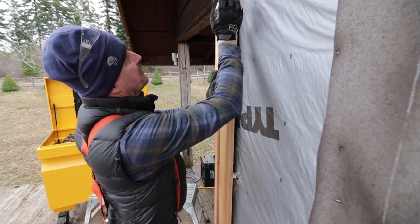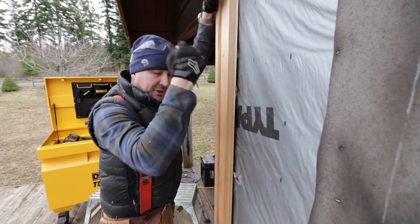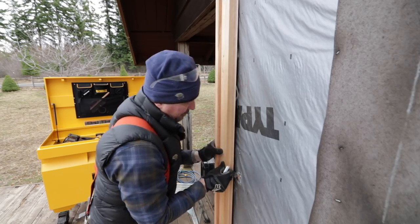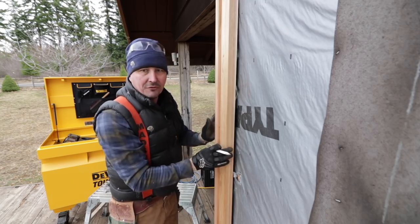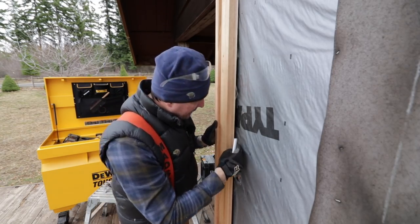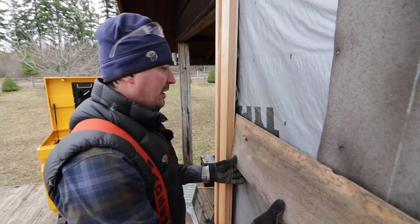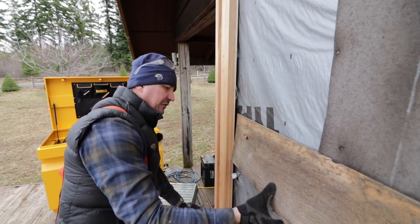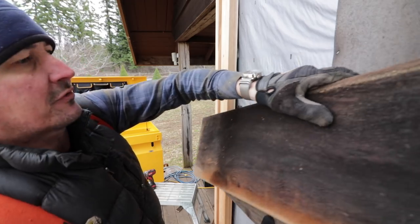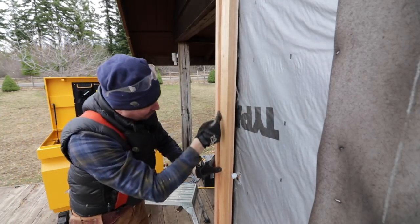Here you can see what we're dealing with. This is the north corner board — touching at the bottom, and we have this much of a gap right there at the top. That's how bowed in everything is. Since the siding is going to run in here, we have a little bit of leeway, but we'll want to push that in. The nails will drive that in. That's why we're going to have to put this piece on first, secure it where it's ultimately going to go, and then scribe the other one to fit. It's just so crooked. As these laps go on — these are going to overlap an inch and a half — if we don't suck that in, there's going to be a big gap. So we're going to nail that in, but we'll have to scribe this to fit.